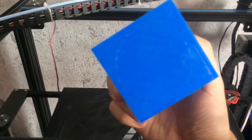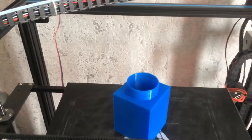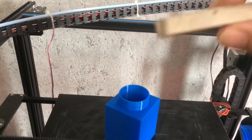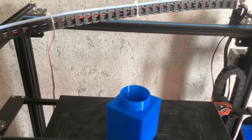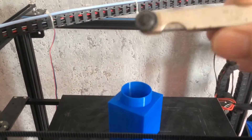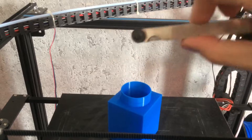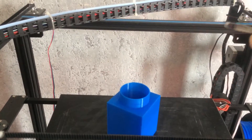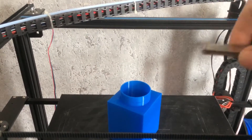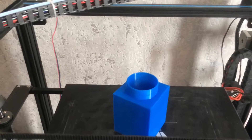As you can see I have sorted out my bottom layer which is nice and perfectly flat now. The secret is to get yourself some metal feeler gauges. Make sure you have got the right feeler gauge height — this one goes from 0.05 to 0.80 millimetres and I set it to 20 as instructed, but I can go down to 15 if I want a closer layer height. As you are doing it, shove one of these underneath and if you can hear a little bit of noise from the Z motor, just raise up very slightly until the noise stops and there you go — you have got your Z height perfectly calibrated. Don't use paper any more as it is inaccurate because it squashes.